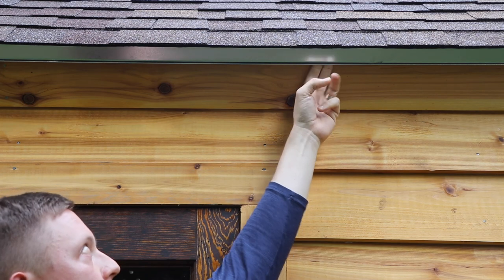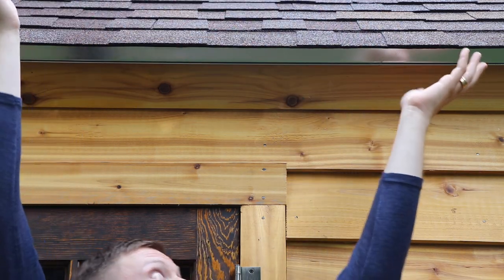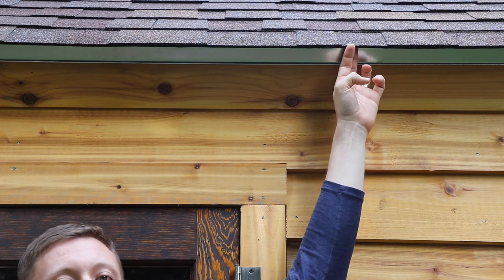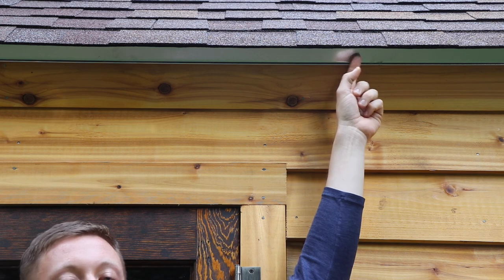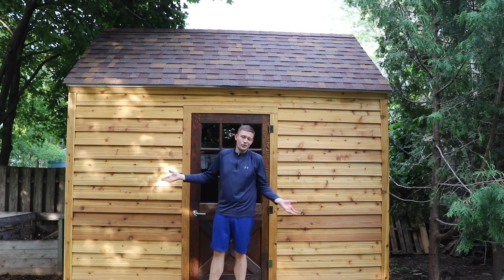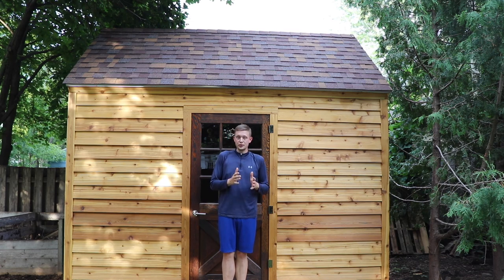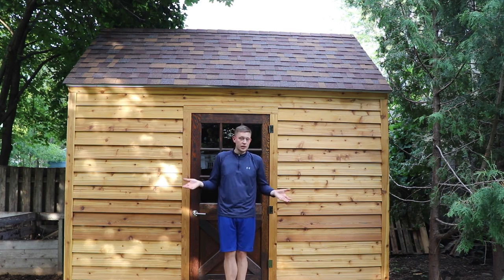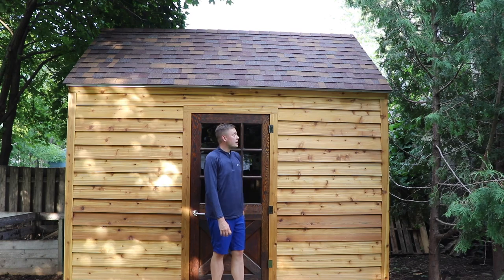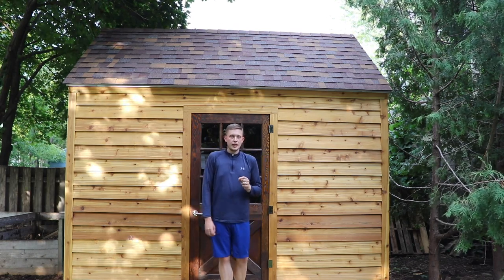So you put the drip edge up along the entire way, and then we do shingles. A finger length for the drip edge, and about a half-inch overlay of my shingles to the drip edge, for the same reason of water surface tension. My roof is hot, and we waited forever for these shingles — supply chain delays due to the COVID-19 pandemic. I opted for Owens Corning shingles, and they were terrific.